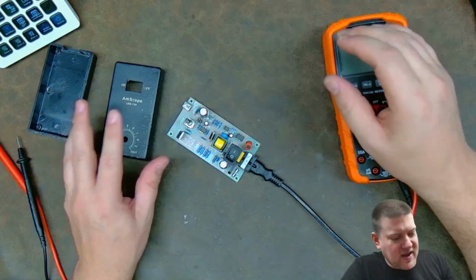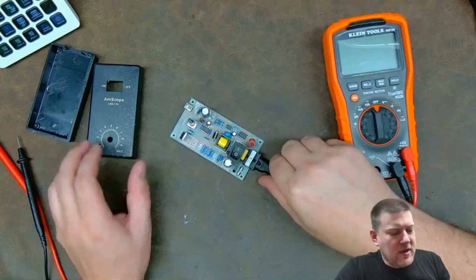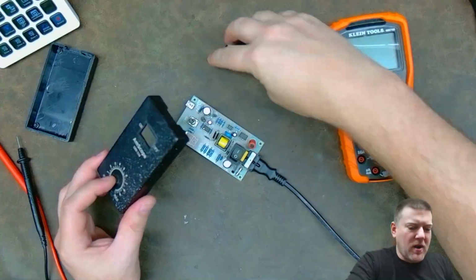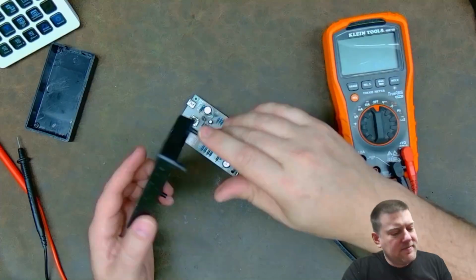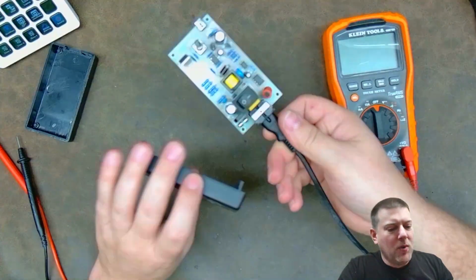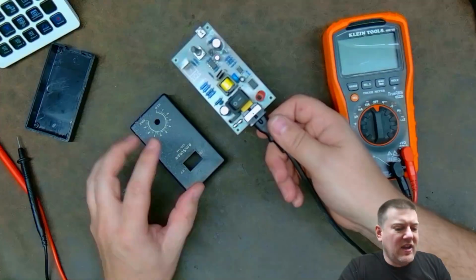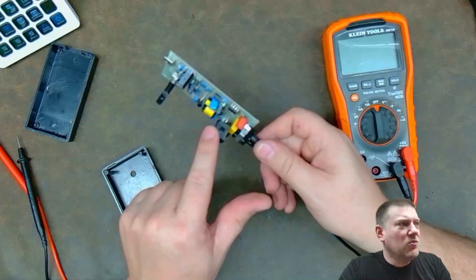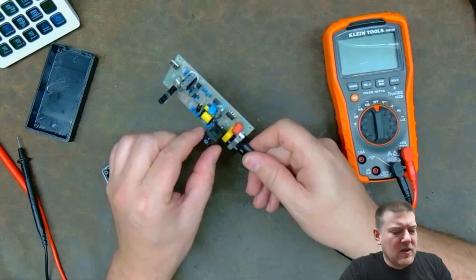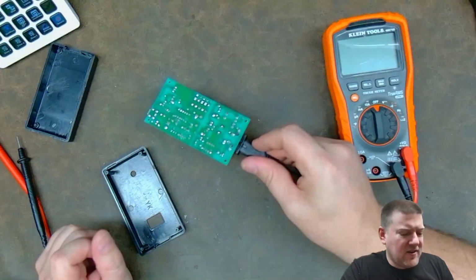So here we go. I've got my Amscope LED 144. And mind you, this guy's live right now. So I can't pull it apart because first you got to remove the knob. Check. No problem. Little flat blade out the bottom. I got it. That's off. It still won't come apart because these noodles, instead of doing a board where everything's soldered from the backside and it just kind of protrudes to the front, they actually had a through panel from the front with 2 lead wires. You can probably barely see, that's why it stood off so far from the PCB. So this guy has got 2 lead wires that reach all the way down, and they're soldered on the back.